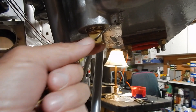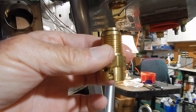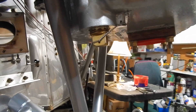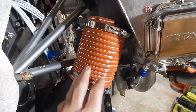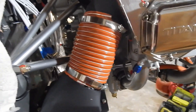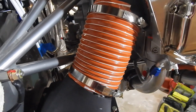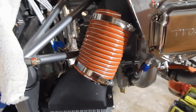The next thing I'm going to do is replace the oil plug that's wire-tied in the bottom of the crankcase. RANS provides a quick-release fitting so you don't have to remove the plug for oil changes — it gets replaced with some sealant. There's about a pint of cylinder maintainer in there to keep the cylinders maintained before you run the engine while it's in storage. I also attached the oil cooler ducting. The manual has it at three inches, but it's now four inches. The Titans had some cooling issues before, and changes were made — going to a 13-row cooler from nine-row, and four-inch ducting from three-inch. I'm assuming that's all to address the cooling issues.